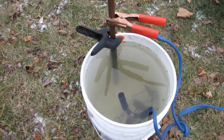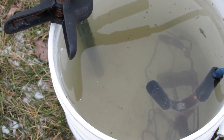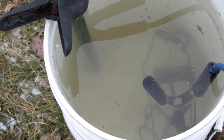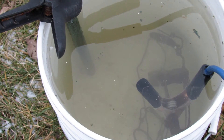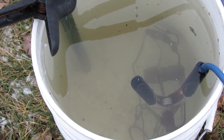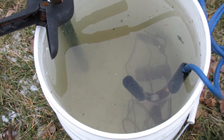This is really dangerous so don't try this at home, kids. We'll basically leave this for several hours — actually probably overnight — just to get the rust off, and eventually it'll kind of look like a soup of rust. Then we'll take the trap out, use a bit of emery cloth to clean it up, and then we'll wax it. So we'll just let this do its thing.